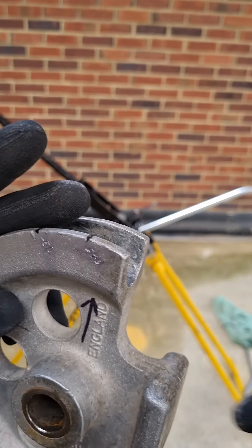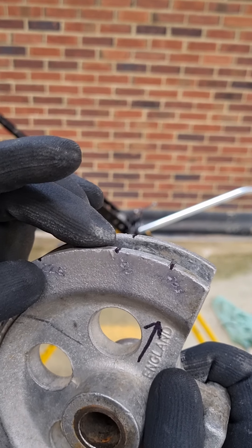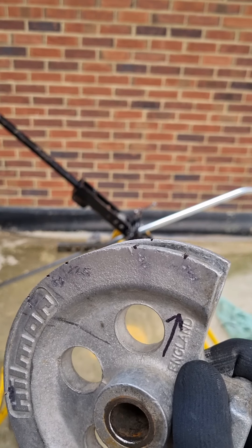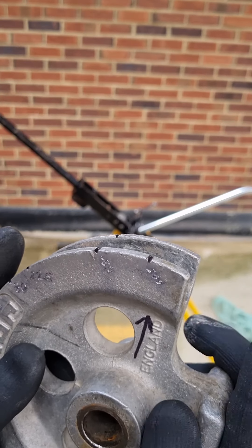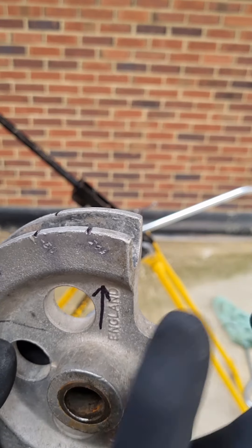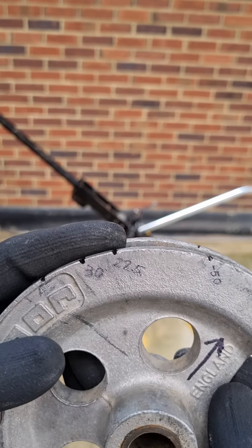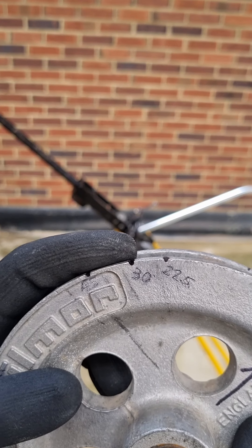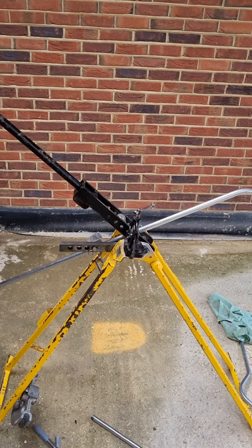If you know exactly where your first bend ends and starts compared to the coupler. Then we've got minus 50 — this is the mark that allows you to, instead of putting a set square on the end of the former, just line it up in there and you'll get it on. It does mean if you're bending from this side of the former, you now need to minus 50 from that measurement, but again, you just line it up in here. We've got 22 and a half degrees, 30 degrees, 45, and 90. I've been playing around with a few bends to get them right. Hope this helps — any questions, drop them in the link below.